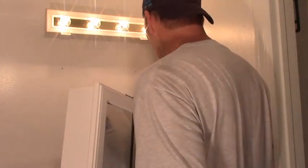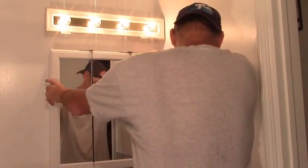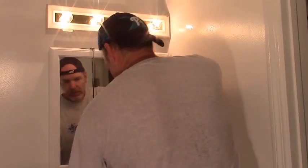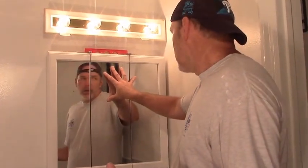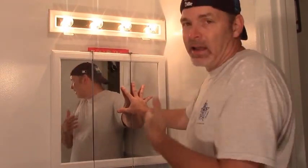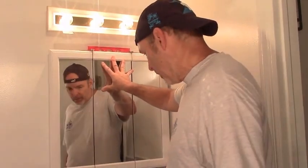I'm going to set my cabinet in place to see where I think I want it. I'm laying mine right on top of the tile because that's where the old one was, and I want it centered over the sink. I can use the old light fixture as a reference too. So I'm going to say that's about right. Next, I want to make sure it's level. I put my level on the top and that's actually not level. When you're hanging a cabinet like this, especially this close to the wall, you kind of have to compromise between level and straight and square. If this side wall was out of plumb and I hung this level but it's not even with the side wall, you'd almost be better off hanging it even with the side wall so you have the same space all the way down. Even though the cabinet may not be perfectly level, it's going to look better. I'm level and my wall is pretty square, so I had the same distance all the way down, which I'm happy with.